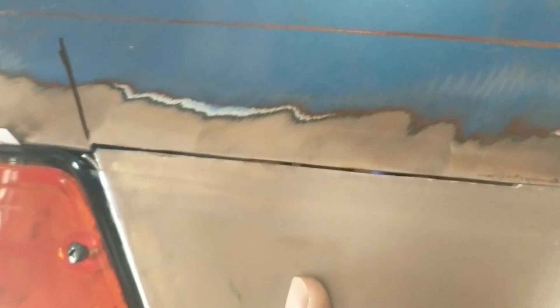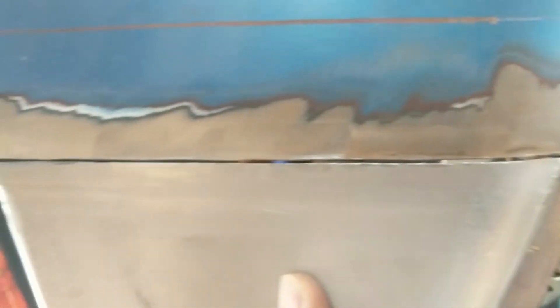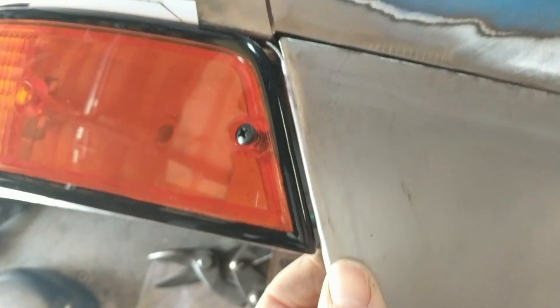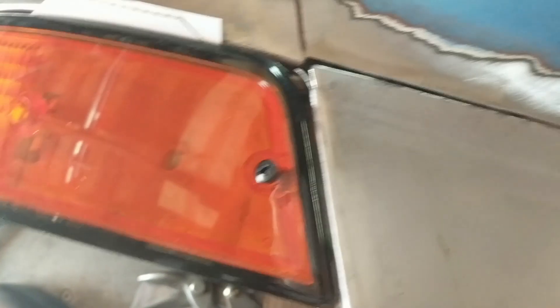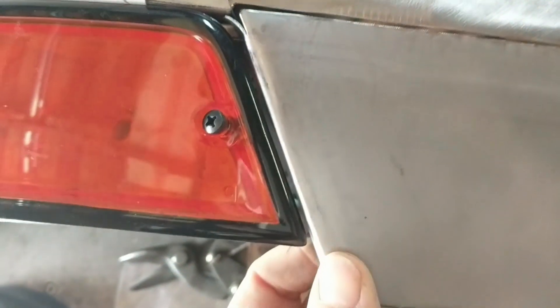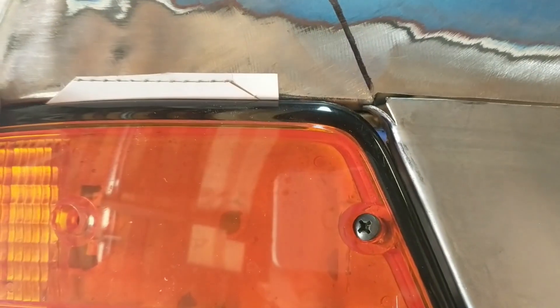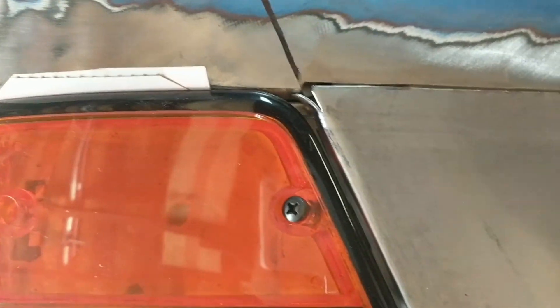There's the gap — it's not very well clamped and I need to close it just a little bit. The clearance to the turn signal is probably an eighth of an inch or maybe slightly less. I have a little cardboard shim in here to account for some paint. This housing is just about where it's going to be.